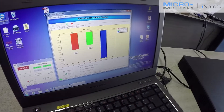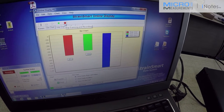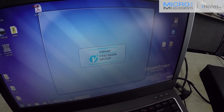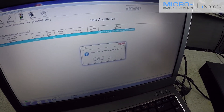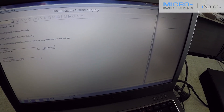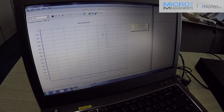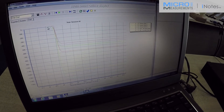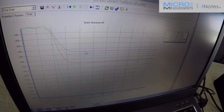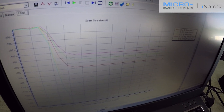I've now got some data. What I'm interested in is not the measured strains, but the calculated principal strains. Remember that my strain gauge is mismatched to the known directions on the can. So I'm going to keep the acquired data and then double click on my scan session and click on chart. I now have a plot of the pressure decaying as I pulled the ring pull. You can see here that I have five strains plotted — both measured strains and the calculated strains.